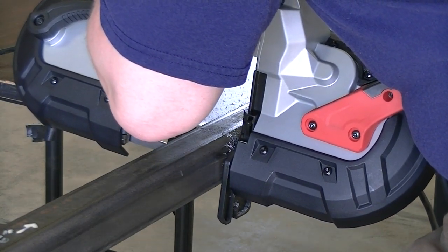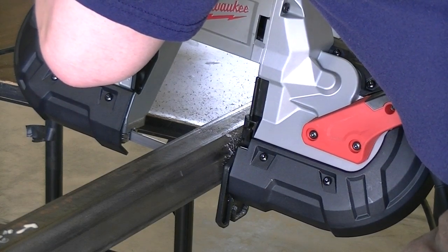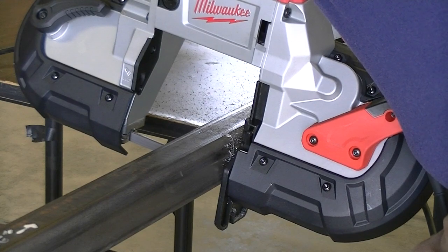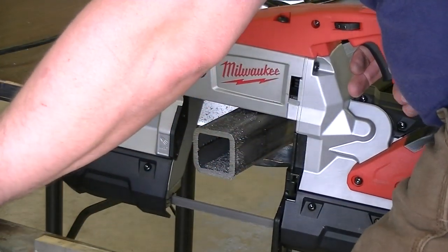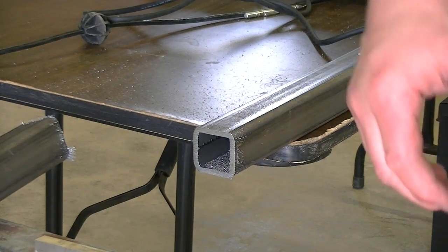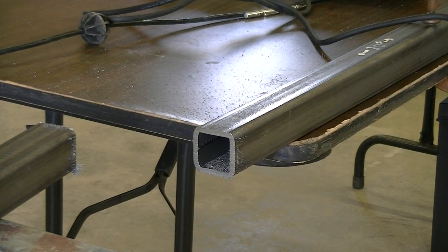I was going back slightly at the bottom part of the cut. I don't know how that turned out — I'll have to review the video. But as you can see, it cuts it quite square. I'll finish cutting the rest of this up; there's no sense in boring you by watching that. I just thought I'd demonstrate how I do it. I don't push down on the saw at all — I let the weight of the saw make the cut.